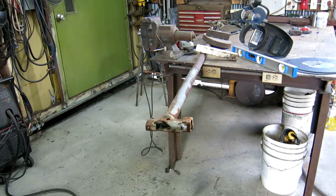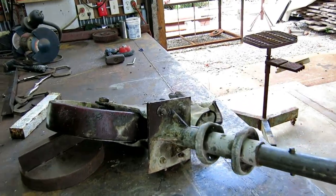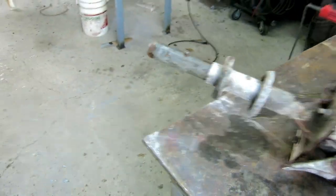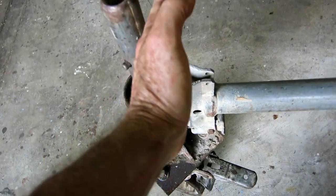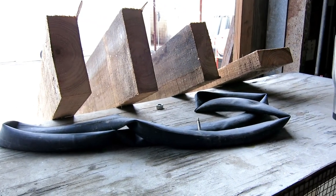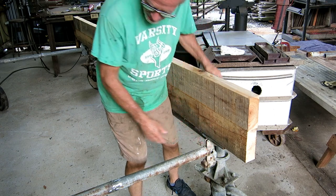I used angle iron to line the pipes before welding them back together, making sure the brackets lined up. One caster had been hit with a mallet, damaging the locking ring, so I had trouble getting the brackets to fit, but I got it straight enough on two sides where the brackets could lock in. One of the things that attracted me to this scaffold is that it just blocks together and comes apart easily.